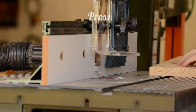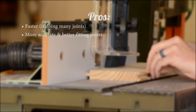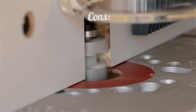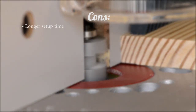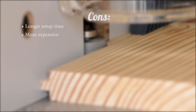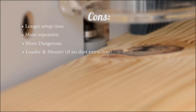For the pros of using a router: it's a lot faster if you're cutting a lot of wood, it's easier to be accurate and often produces better fitting joints after you've got it dialed in, and the fast rotation of the sharp cutters works better with difficult grain. Cons of using a router: it takes more time to set up than a tongue and groove plane, it can be more expensive if you don't already have a router, router table, and router bits, it can be dangerous if you don't use safety precautions, and it's definitely louder and messier if you don't use proper dust extraction.